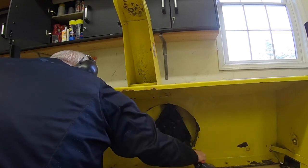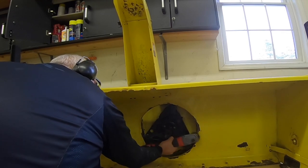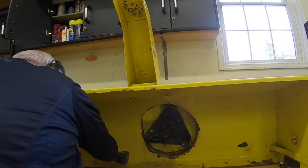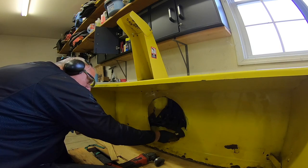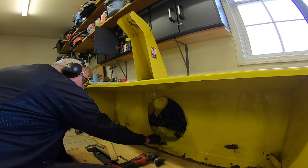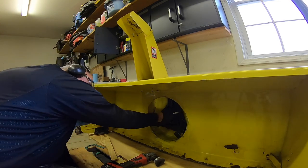I'm using my five-inch grinder to take off some surface rust and some paint in preparation to do a quick touch-up on the snowblower shell. This five-inch cordless grinder is a great tool. I switched it up with the wire brush cup on there, and I'm cleaning it up, ready for touch-up work — it worked extremely well. And the reason I'm touching it up with the auger out is that it's the easiest time to get in there.